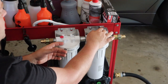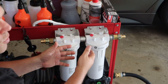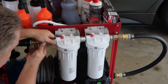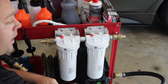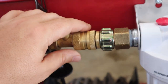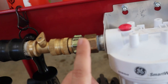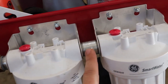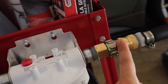If you want to take them off you can pop them off no problem. The nuts and bolts holding it on are separate from what comes with the filtration systems — those come with screws and anchors meant for walls. We set it up with quick disconnects on both sides. We have a big one-inch inlet, a three-quarter-inch water hose brass shutoff, the quick disconnect that goes with it, and a three-quarter-inch to water-spigot-style end with three-quarter-inch double male thread.